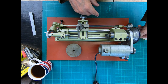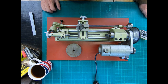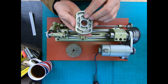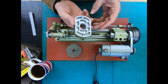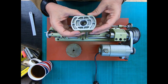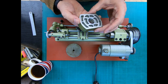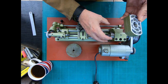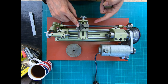Okay, so that's it - we've now seen a riser block. These go for silly money - to me it's a lump of aluminium with a hole drilled in it. I know it's shaped to match, but you're looking at about 50 pounds here in the UK, which is quite a lot. In reality, one could just make one yourself, and I know one of the guys has 3D printed one and is experimenting with that. The other thing is when you've got the riser block on and lift the center height up, that's fine, but your tailstock is still on the lower level and your cutting tools are on the lower level.